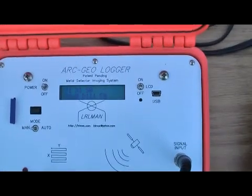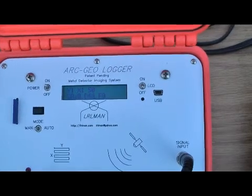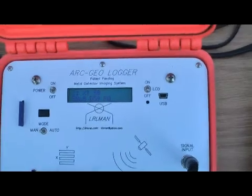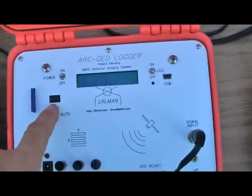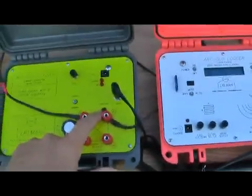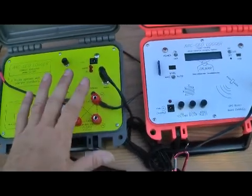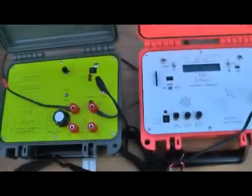You see it getting lower now? You want to set it at about 50 or so up in that area. Once you get that set, release the button. This stays here now. That's how you set threshold. You only set threshold once — you don't fool with it anymore. This position switch is set. Don't touch them anymore.